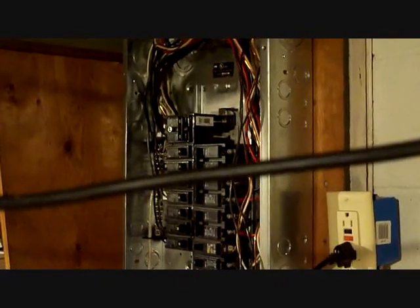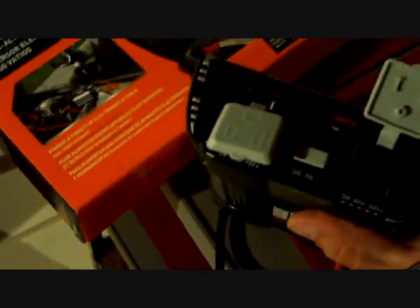Next to my panel here, I'm going to have regular household switches. What's going to happen is I'm going to take a regular AC plug — you put the plug in here and then there. You cut the extension cord, or if you want to use 12-gauge wire you can do that too, which is what I'm going to do — run it into a switch box like this so I can turn them off or on.